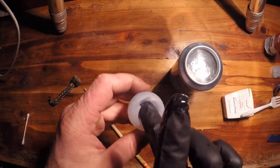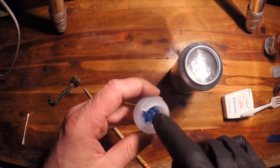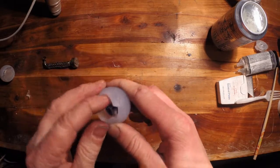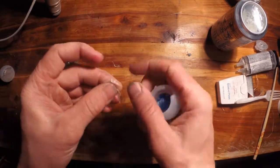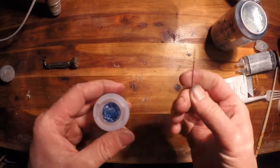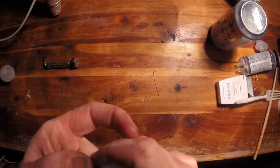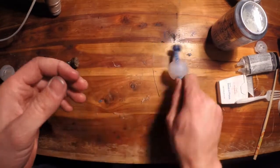I'm going to let this sit for a minute — it'll probably take only two more minutes and this stuff will be pretty damn hard. Okay, I'm back — it's been about ten minutes. Just run your fingernail along the inside of that and you'll get all the excess stuff to come right out. If you let it set longer it might harden up more and not be as easy to pull off. You can push and twist your rope out, just pop it out and make sure you got a good solid plug in there. Stuff is rock solid.